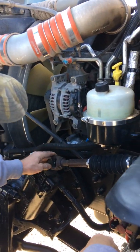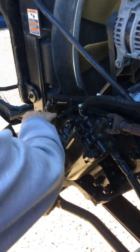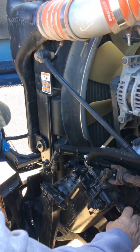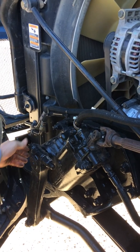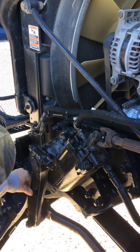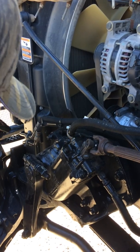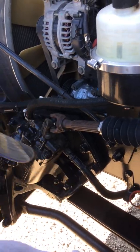I'm going to talk about my steering linkage. It's not cracked or broken, with no excessive movement. I've got a U-joint — it's not worn, torn, or cracked, and it's properly greased on both ends. Now my steering box: no loose or missing bolts, secure and tight. Hoses, clamps, and fittings do not leak, and it's properly greased. Over here is my pitman arm — no loose or missing bolts, secure and tight, not cracked, no weld repairs. There's my drag link — not loose or missing, properly greased, with a crown nut and cotter pin on each end.